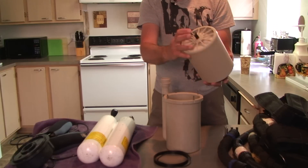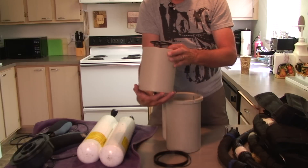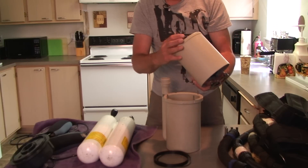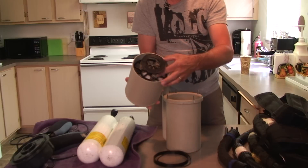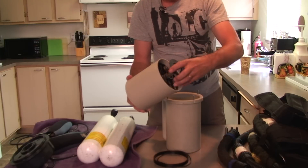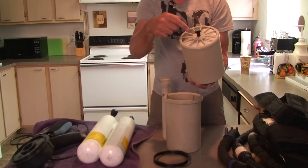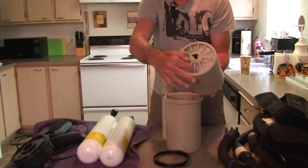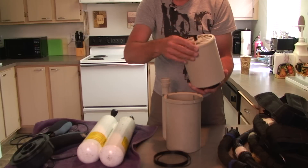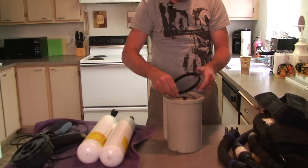Here's the O-ring. It's clean and uncracked. It feels lubed with crystal lube — I can feel a little crystal lube on there. Fits in there nice and tidy and neat. Inside here's where you put the scrubber material. It's got the scrim on top and bottom, which is white and clean. The screw action here is smooth. Springs look great, no corrosion, no cracks. Sometimes if you screw this thing down too tight, you can crack the top of it — but no one's done that. That looks in excellent condition.